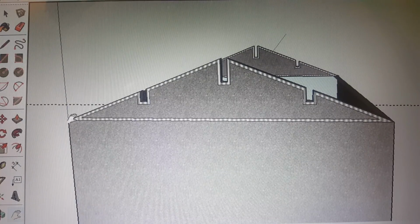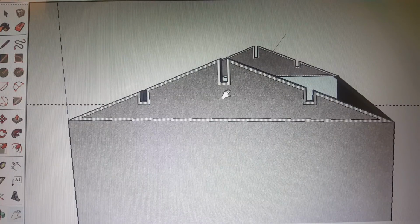Once I got this all put together, this span right here that goes 12 feet, I was worried that when I lay it flat and put the mesh in it and then pour it, this would try to belly out this way, and that this would flex and kind of arc a little bit like that. So I put a post there and just tack welded it in so that we wouldn't be bridging such a far point. It'd only be bridging 6 feet and it wouldn't flex out. There has been just a slight deflection, even for me spanning 7.5 feet, where it would deflect out maybe 1/16 of an inch or so. But spanning 12 feet, I put my finger on it and pulled on it a little, and I just thought it was too much.